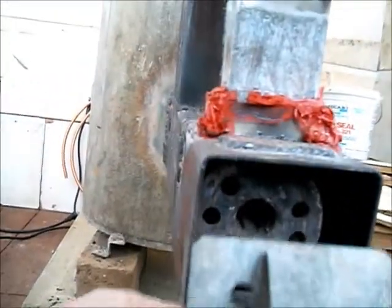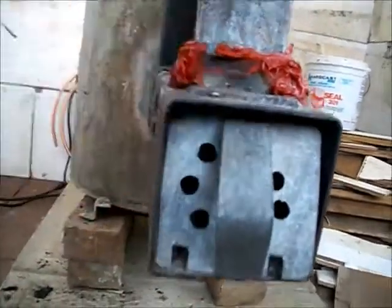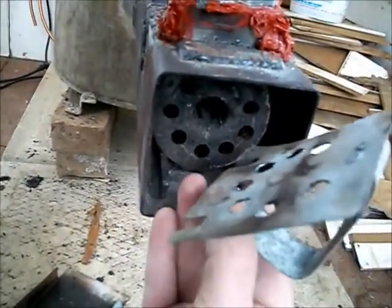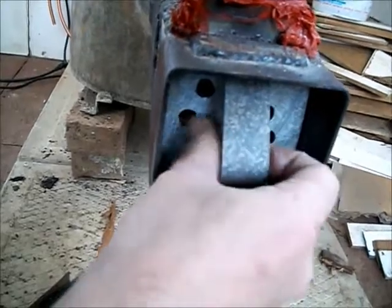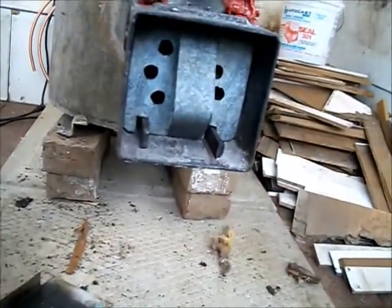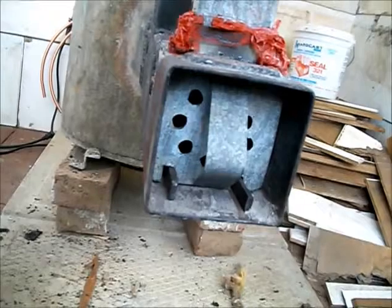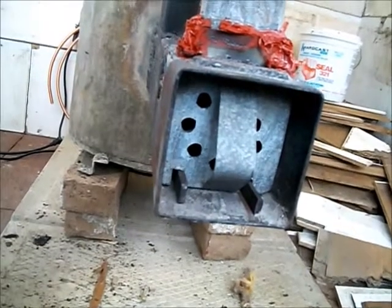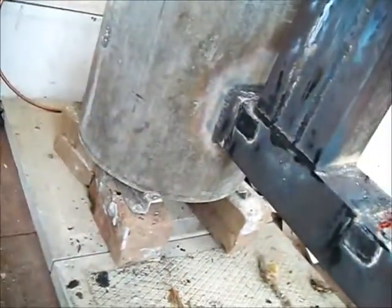So what I made myself is a little plate. Now I've got to align this. That plugs up pretty well everything but the holes in the burner. What that does is concentrate the airflow and brings up the temperature to 450 degrees on the top of my stove. If I had this part closer to the stove itself, I believe I could get even higher.